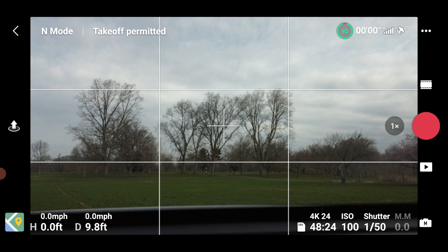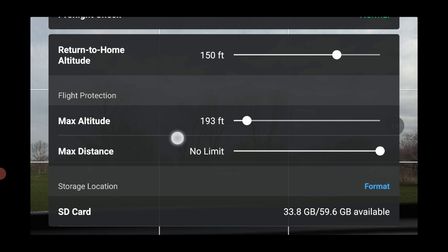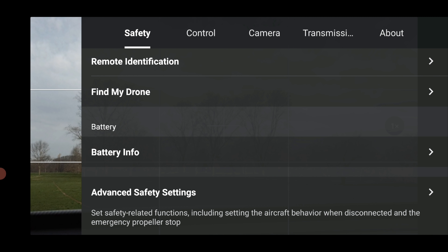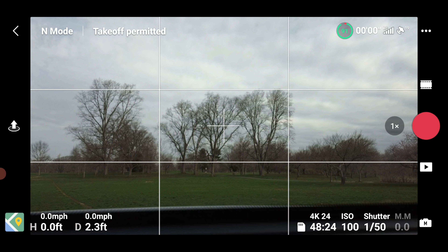Before we get started, I'm going to do my safety checks. I'm going to go over here to the checklist and I have my return home height set to 150, which is good around here. My max altitude I'm going to bring down to maybe 193 to 195. My max distance I'm going to have to no limit. I'm also going to go into the safety menu and make sure my loss of signal is set to return to home. I will be recording in 4K, 24 frames per second. ISO is set to 100 and my shutter speed is 1/50th of a second. Right now I'm perfectly exposed, so all we need to do now is go ahead and launch.